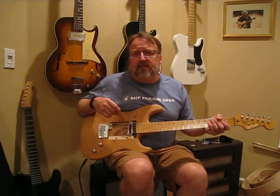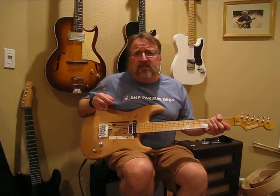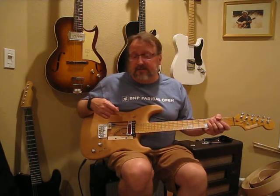So anyway, I ended up winding it with 45 gauge wire, same as the D'Armond. It's a thinner coil, not as fat as the D'Armond, almost by about half. So I knew it would be a little bit brighter. And I put about the same number of winds, although it winds up being less wire because the D'Armond coil is actually thicker — it has a bigger area to it.